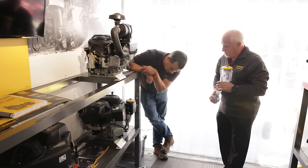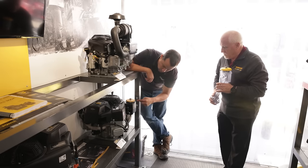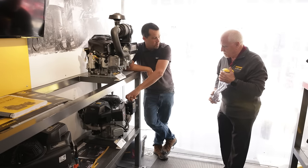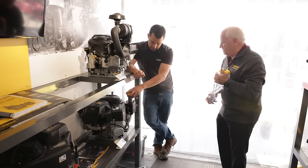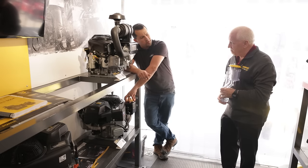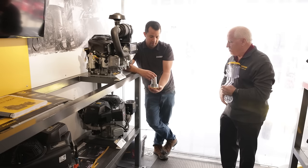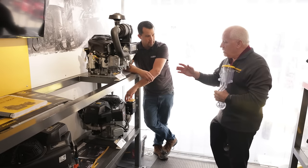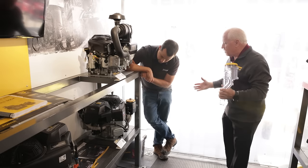So really a compact version of that system. You talked about cooling — this is metal coming up from down here, and you're running oil up through that loop and it cools going through all that. Some of the maintenance things — if it's easy and quick access, guys are going to do it more often. Could you do this without changing the oil on the engine? Typically we like to recommend that you do all the maintenance together with it. But since it's a 250 hour maintenance engine — no air filter, no spark plug, nothing else for 250 hours — so it's in for one thing, you do them all.